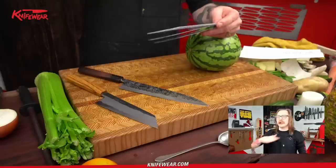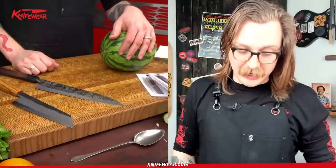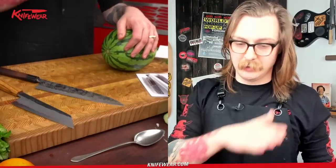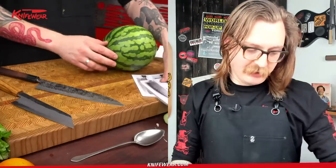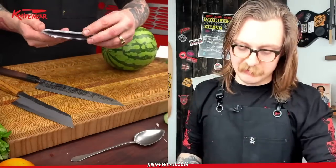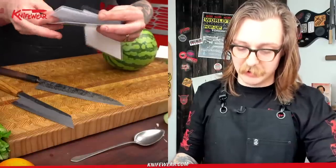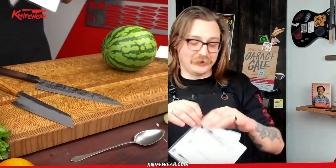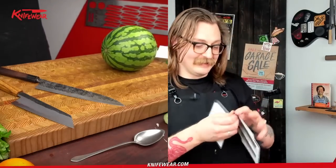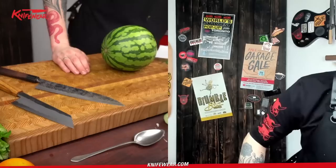One of the things that really stands out is that a lot of knives have horizontal or vertical grinding lines on them, and when you thin it out, it totally changes that scratch pattern along the bevel. So we sometimes use a horizontal belt to even that out. We don't have a mirror polish one in here because we just don't sharpen that many mirror polish knives, and we try to avoid thinning them if we can. Cool. Hope that helps.